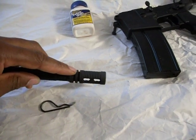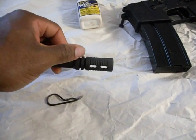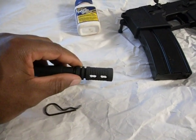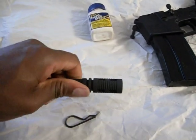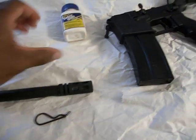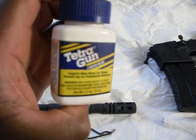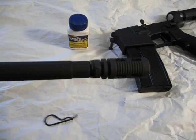When I used the punch and tapped the top, it went very flush with the brake. I realized I didn't have to weld it because there's no way you're going to get that out — it has swollen into the metal of the muzzle brake and the barrel. When you rub your finger over it you don't feel anything. Afterwards I used gun blue, ordered from Bushmaster, to blue the pin.